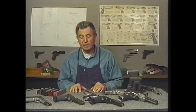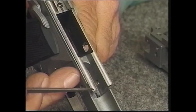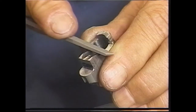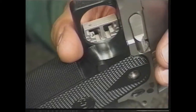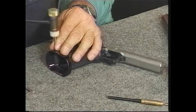In Volume 3, Gene shows you how to build the ultimate double-stack pistol from the ground up, from choosing your options through the entire building process. Some of the special highlights include showing you the Accurail system, reaming the chamber and head spacing, ramping and polishing the barrel, fitting a reverse plug and guide rod, performing over-travel adjustments, the Tri-Glide system, how to serrate the slide, mill the slide, and install a mag well.